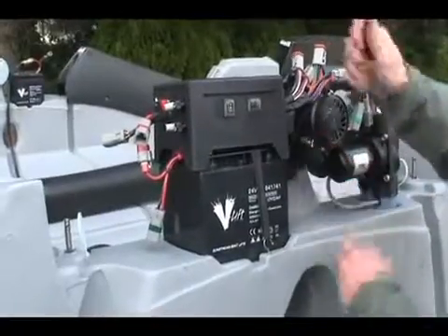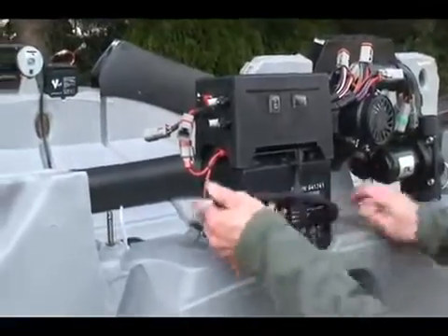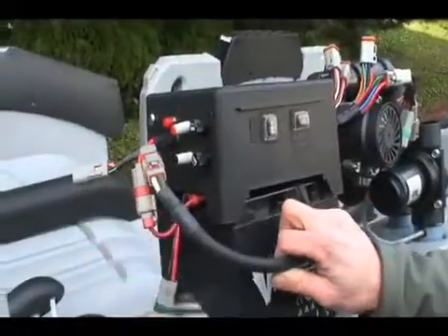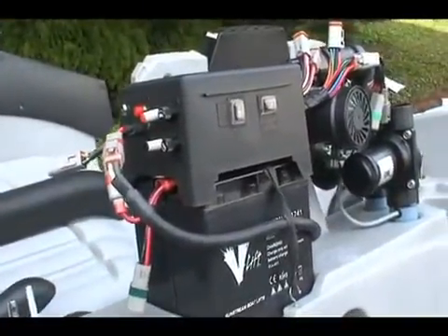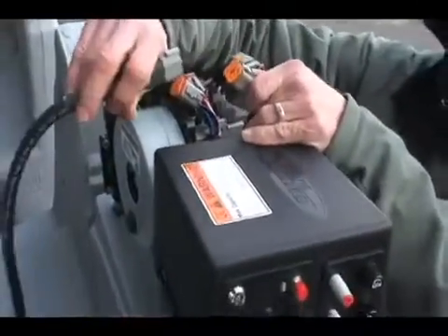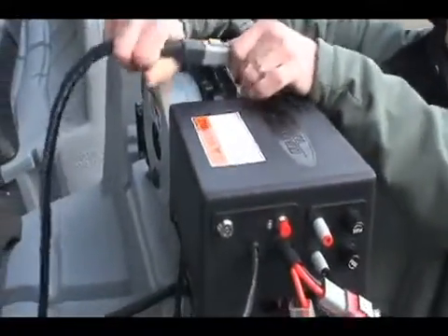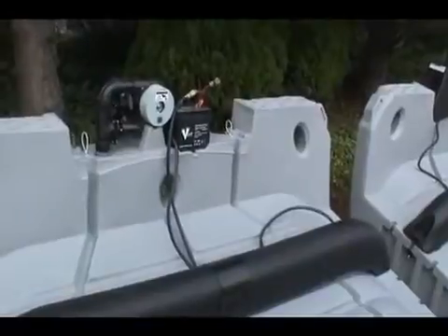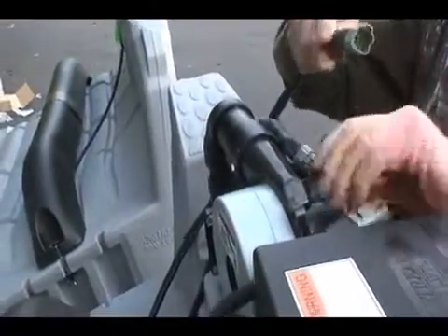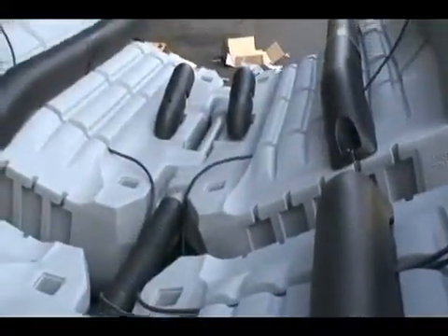Position the plugs and wires above the level of the valves. Route this cable under the strap and connect to the RC. It's very important to have both batteries hooked up so one battery is not overdrawn and blows a fuse. Run the harness to the RC, again running underneath the bunks to the opposite tank. Finally, connect the two long six-pin harnesses from the forward tanks, under the bunks, across the union, and back up to the RC.